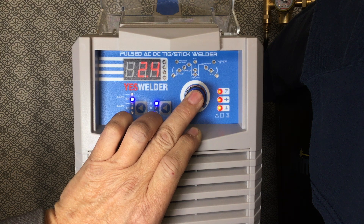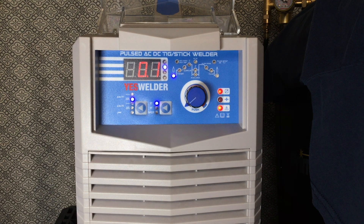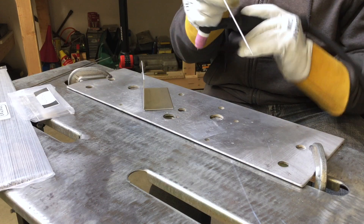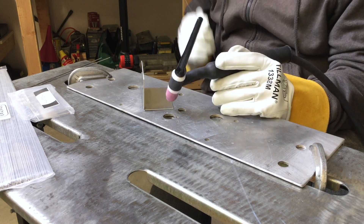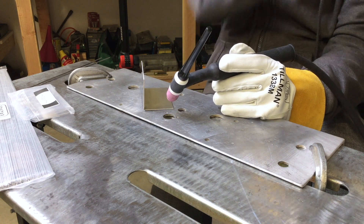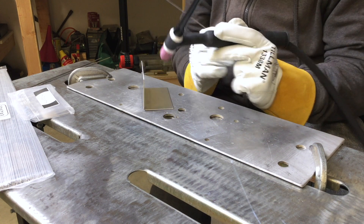No down slope, 5 amps on the stop amperage, 5 seconds of post-flow, 2.4mm — which is 3/32nds — tungsten. I'm going to run just a straight flat bead on a flat piece before I try to do the autogenous weld on the corner. Just so everyone understands: if you're new to the channel, I'm a beginner TIG welder myself, so I'm learning this right along with making the video.